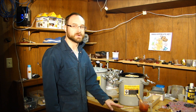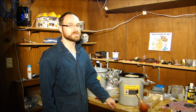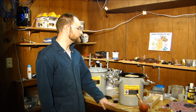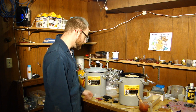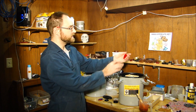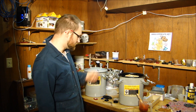I used to do a lot of resin casting by just pouring the resin or rubber in the mold box and then using a vibrating table to shake all the air bubbles out, but I didn't like the results — it wasn't really as air-bubble-free as I wanted. With this setup I can actually get close to zero air bubbles. It doesn't push all the air bubbles out; it sort of compresses them so small you can't even see them, so this allows me to get almost crystal clear, zero air bubbles, pretty high detail. These are pretty low detail shapes but you can see that they're pretty clear.